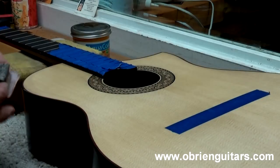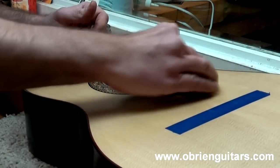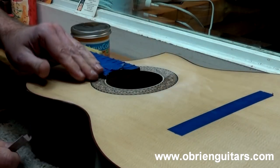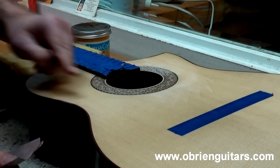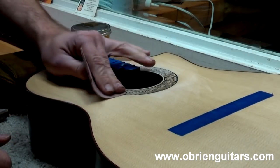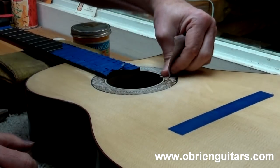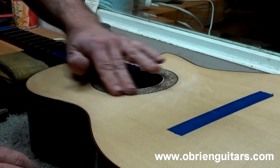This is a great candidate for rosettes that have already begun the finishing process and then you notice a low area. I want to give it a little bite, so I'm going to come in and lightly sand the rosette area — any small divots and low areas need to be sanded so the filler has something to grab onto. If you decided to use your finish to level these areas with a high-solids product like lacquer or urethane polyester, eventually you'd get them filled, but you'd probably have a little shrink-back over time. So I like to use a leveling agent — in this case, the water-based pore filler by Aqua Coat.